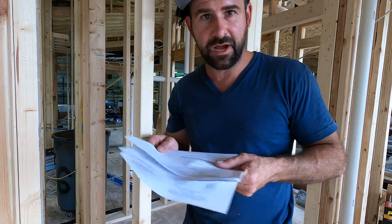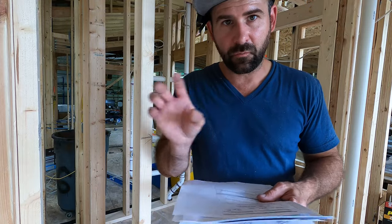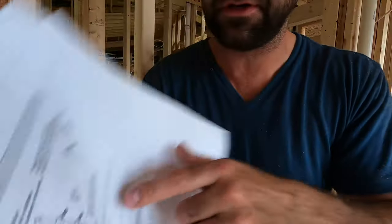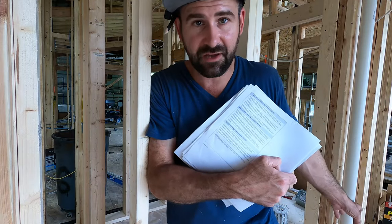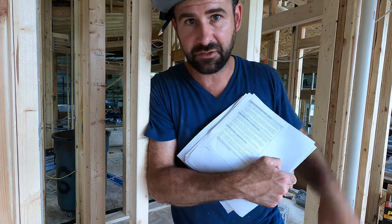First word to the wise: if you're doing more than one body sprayer on the same shower circuit, you're going to want to do an equalizer loop where you have equal pieces of pipe so that when the water comes out it's dispersed evenly. If you have extra ports on your valve — like I've got six ports on this valve — there's zero sense trying to do that equalizer loop. Instead, we're just going to zone out each of the body sprayers so we don't have any water pressure problems.